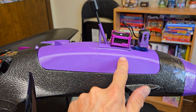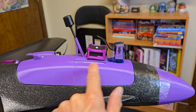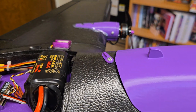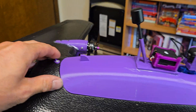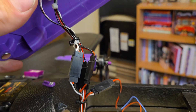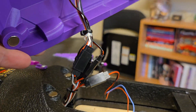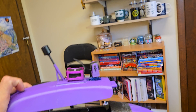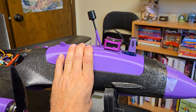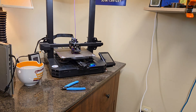It's four or five pieces: the front hatch, the rear hatch, the camera holder, and the VTX and antenna holder. You can also add another little hatch lock. What makes this nice is when I pull this up you can see all my leads right there, so to transfer from one plane I just unplug everything and it goes to the next plane. It also gives the airframe a little structural support.